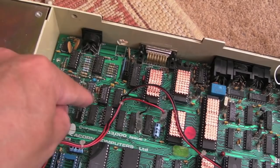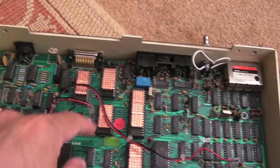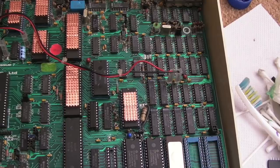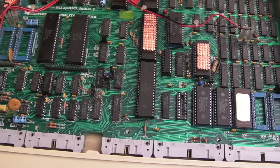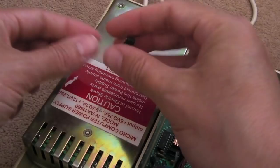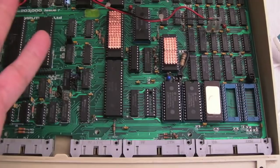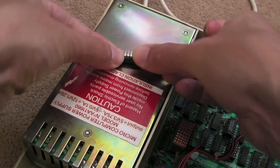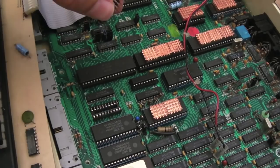We're waiting for the 74LS245N to complete this board. Initially I'll only be able to test the user port. For the connector with bent pins, I put it on a flat metal surface and rolled it to straighten the profile — it should now go in easily. I'm wearing an ESD wrist strap for this.